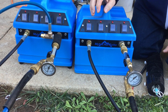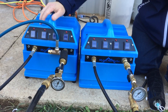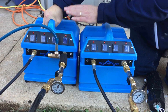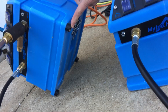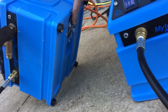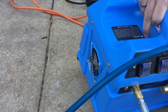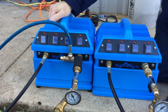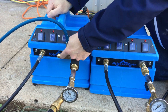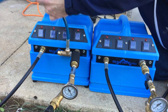This time we're going to do the opposite. I want to tell you about some of the changes because it did get so hot. We added some additional cooling to this one — we put some rubber feet on it and a vent hole on the bottom, as well as one on the side here. Just through normal convection, some of the hot air inside would help cool it off. We also put a 600 PSI safety pressure relief valve.